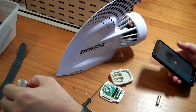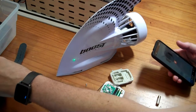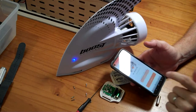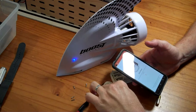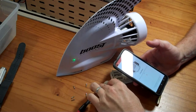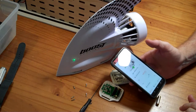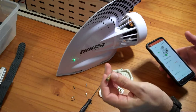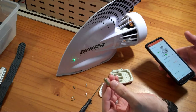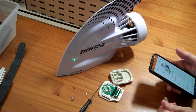Restarted the app, it found the fin, going to try connecting the remote. I saw a light flash - it noticed the remote! Now I can pair the other end and we're back in business, as soon as I get a good battery. The problem was the battery in the remote had gotten down to 2 volts. I'm not sure if it had gotten shorted out, or if it's just calendar age or a bad battery to begin with. I need to go find the right diameter battery so I can put it back in the case, but that was the problem with my remote.